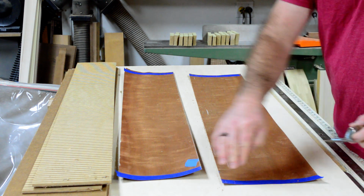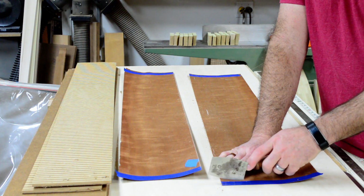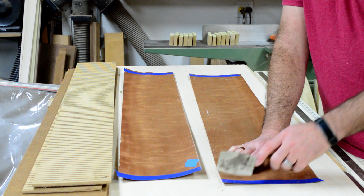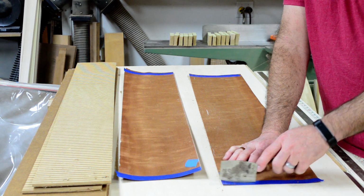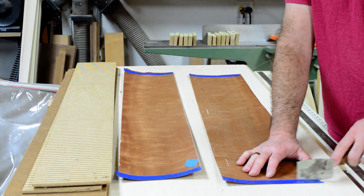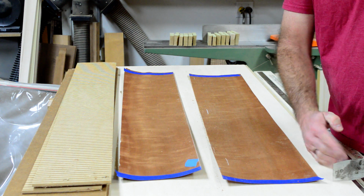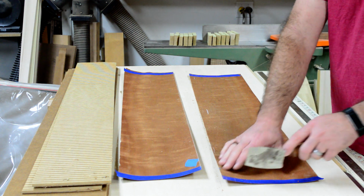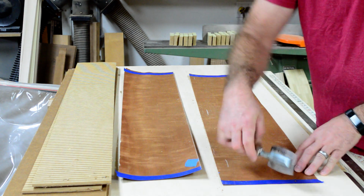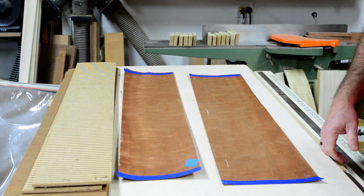So again, using a straight edge here, I can pull off of the veneer as I'm sawing it, and with the radius edge of the saw, you do want to find all of those teeth as you're cutting. The real danger here is when you cross cut, because anything that happens where you're cutting, all of the material that you want to save is going to start to tear out in big swaths. So I always cut towards the center of the board on both of these, and then that minimizes any of that splitting that happens if you need to use a veneer saw for that.